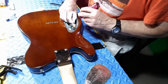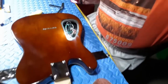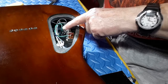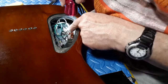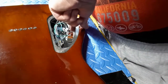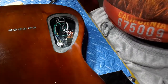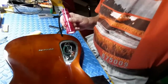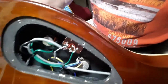So they have a pigtail here. I can show it. They have a little pigtail here that jumpers the two coils together, which means that they could possibly be split. Looks like the brown cap, which is probably a 47. No markings on it that I can see from this angle. But yes, the overall work inside the cavity is not that bad at all. Sorry for the bounciness. I just wanted to pick this up and give you a shot in there.